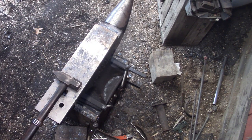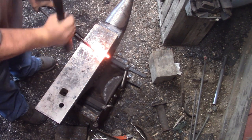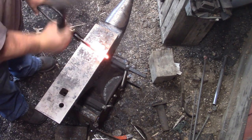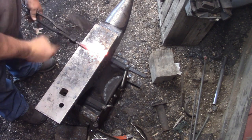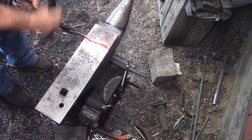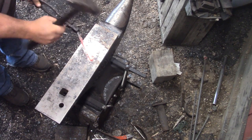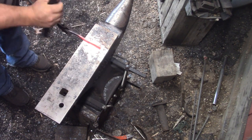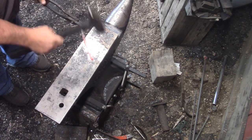But trying to think of how to describe that. So you're looking at this 4-inch square piece, and you cut all the way across a 1/2 inch from the edge. You stop and you cut all the way down a 1/2 inch from the edge, and then you have approximately 8 inches of 1/2 inch wide by, I believe it was 1/4 inch thick, stainless steel piece.